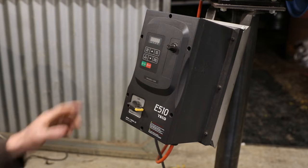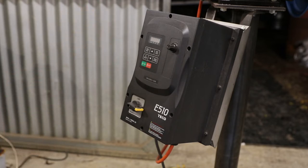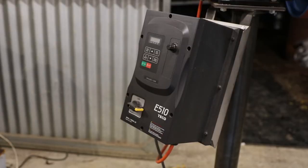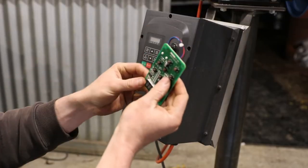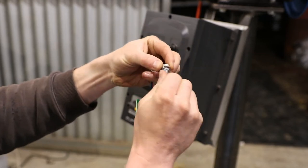If you're getting the fault where it's really erratic or the numbers just keep going up and down, it won't hold a stable speed while you're using the potentiometer, or some of them aren't going to their maximum or minimum speeds anymore — what we need to do is replace the potentiometer.